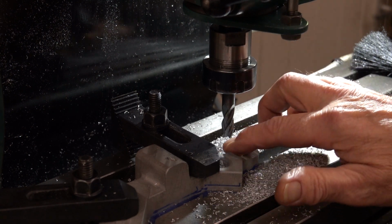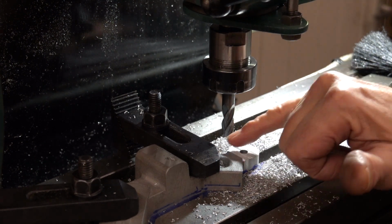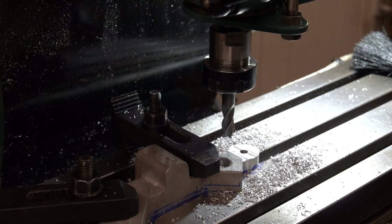Four point seven six two from either side in metric. I've taken that to 4.755. So I'm under. I've gone under. And then when I've cut the slot, if I cock that up, I can adjust. I can always bring this back. It's dead easy to set up, so I can always bring this back. And